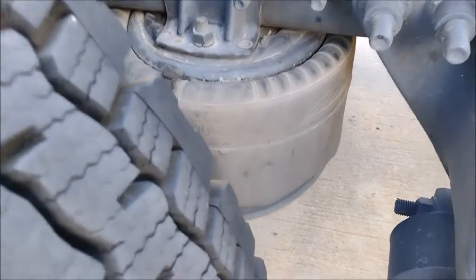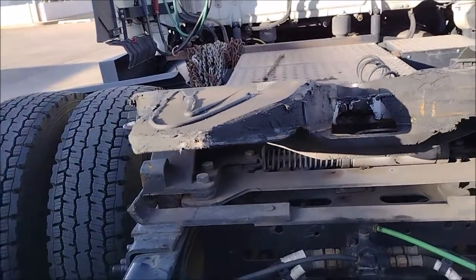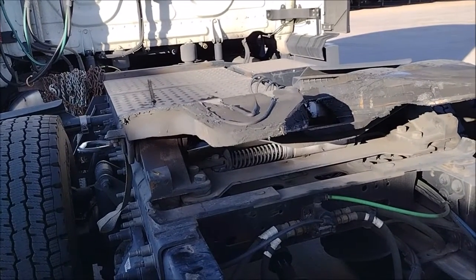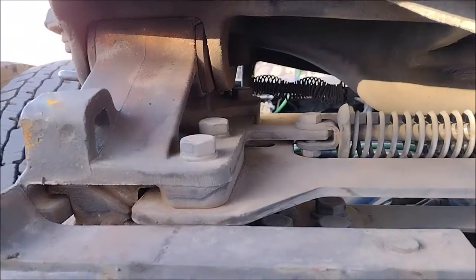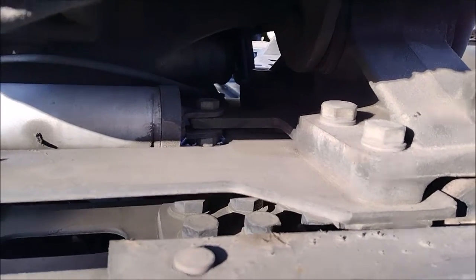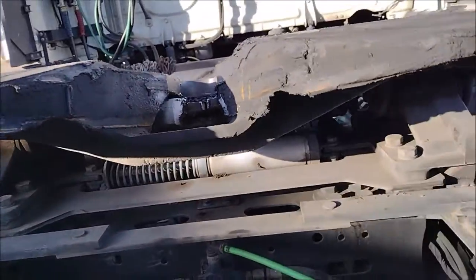this airbag is deflated. So all of them are deflated now. I needed to turn the truck on and activate the pneumatic piston to pull the latches. One latch is here, one latch is here. You can look with your eyes now to make sure that you see the position before you activate the pneumatic piston. The position means the latches are in the grooves.